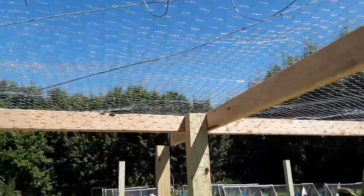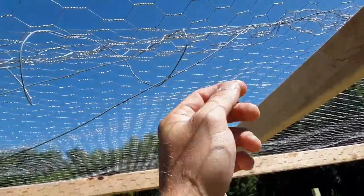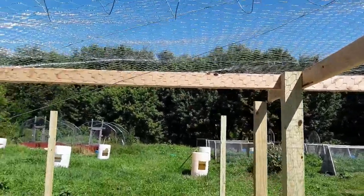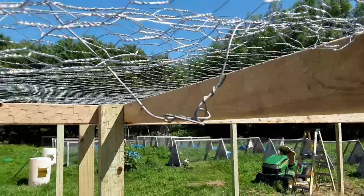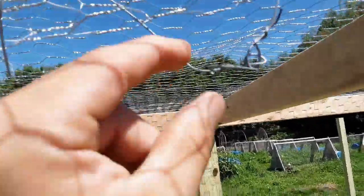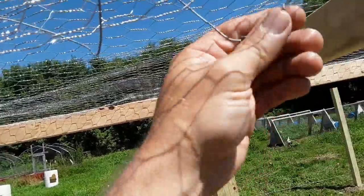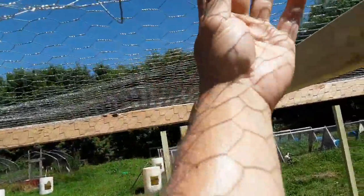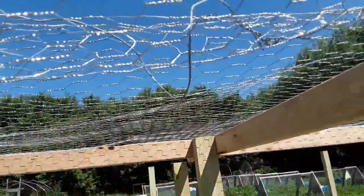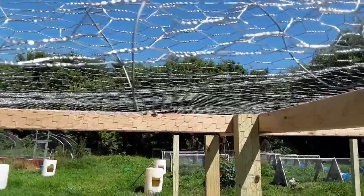What I'm going to do is cut it and splice it. I'm going to cut it about here and take all this slack off because we're going to end up with it being extra anyway by the time we get to the end. I've spliced it — I've looped it together. You want to try and keep your loops small, and this tail here you want to bend it back in this direction because you're pulling this way and it'll just catch otherwise. It's a good idea to try and make your seam as close to the wire as you can. You can also do this if you misjudged the amount of wire you needed and came up short.